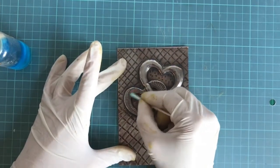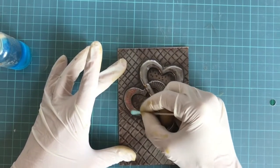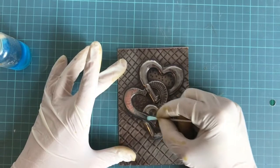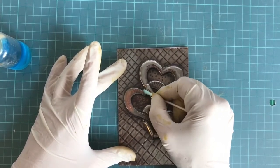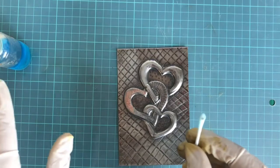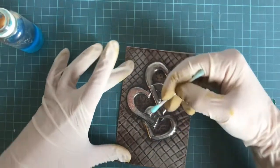Oh yes, it's working perfectly! A copper patina just adds a new dimension — another fun thing you can do with your pewter. This won't work on aluminium. Again, don't dip the part you've just used back inside your container; use the other side, because we don't want to contaminate our patina.